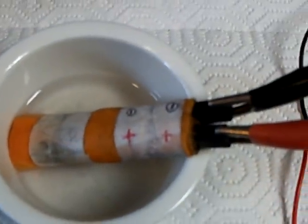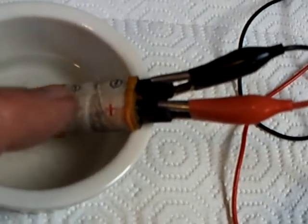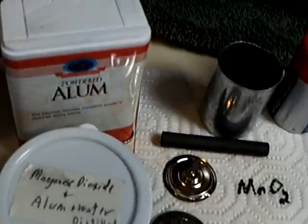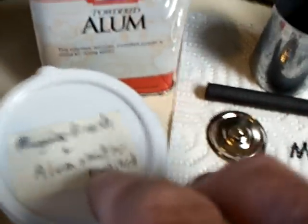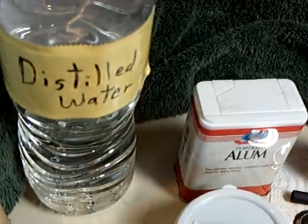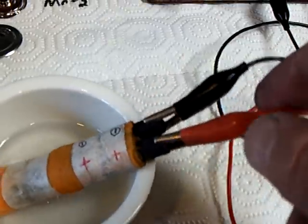Then form it up with a 6-volt battery by charging and discharging repeatedly to get the cell to form up. I believe it's the sulfate that's forming up on either side. This is manganese dioxide with ammonium aluminum sulfate and distilled water. The carbon rods are benign — there's no chemical reaction going on there and no potential between them, since it's carbon on carbon. The reaction is between the manganese dioxide, the ammonium aluminum sulfate, and the water solution, causing ion transfer and a buildup of electrons on the two electrodes depending on how you charge it.